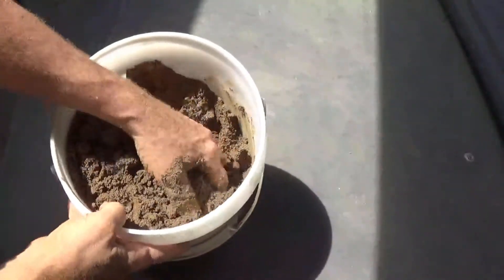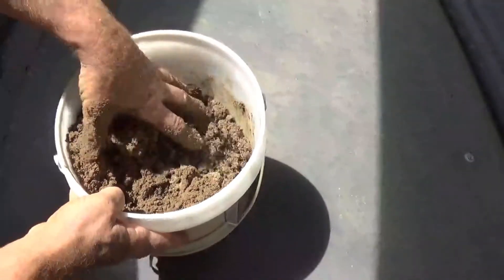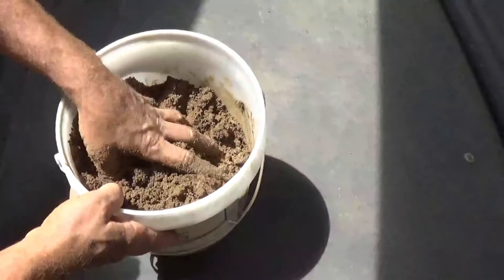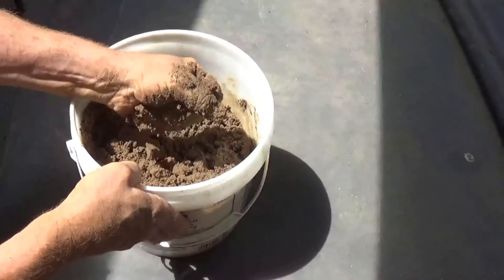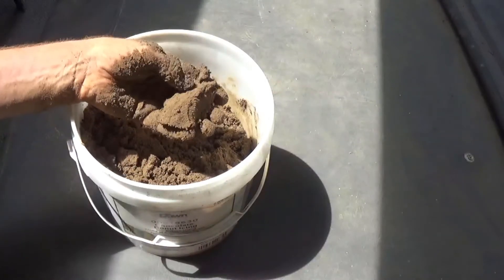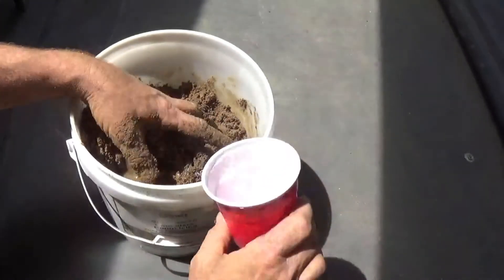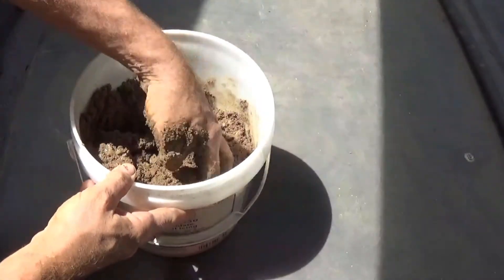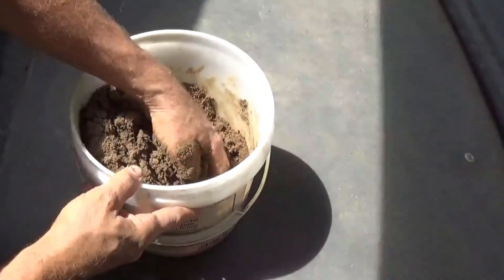What you're really trying to do here is get the sand and clay mixed so the clay is sticking on the outside of the sand. Whenever you pound this in, make it one piece and heat it up, the clay is actually going to fuse together. This is a pretty good mix — I could probably use a little more water. You can see how it kind of holds together in a clump but breaks easily. I've used about two-thirds of a cup of water. I'll add a little more and let this sit overnight. You can probably use it right away, but anytime I've done refractory work, I've always let it sit overnight so everything gets soaked in together.